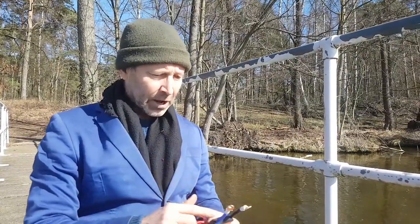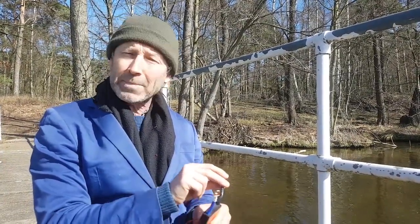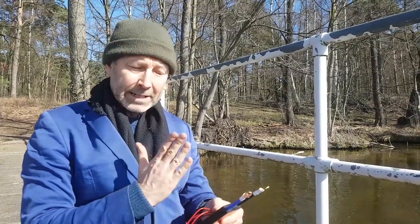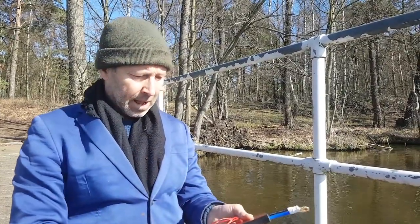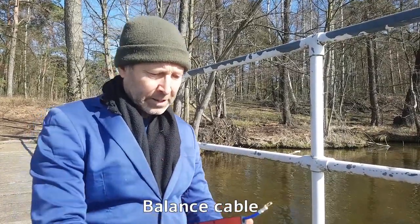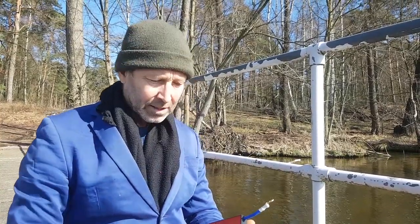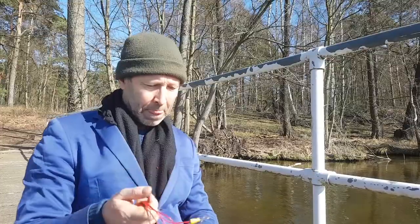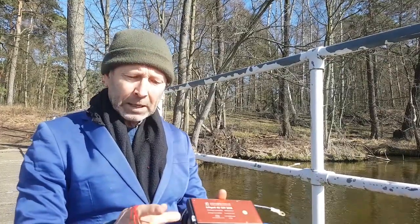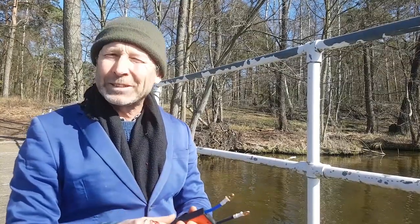Right. The blue one is the negative. This goes to the main negative. And then this is the negative which comes through and goes to your main battery system negative. So basically this breaks the negative. Then the charge controlling cable, the main negative goes to the main negative, and then they cycle through red, red, red, red, each one. When you're finished, you plug it into here and measure the voltage coming out. If it's the correct voltage, you've wired it up correctly.